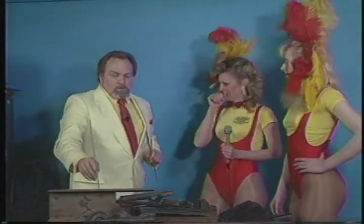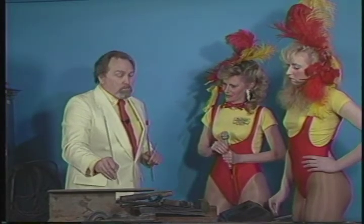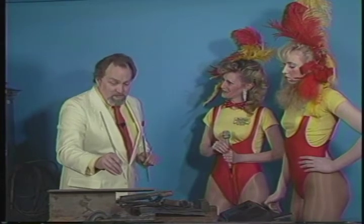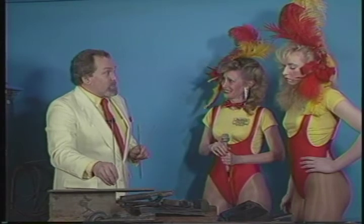And the reason is, in order to properly establish the arc, you scratch it. And part of that scratching motion has to be that you pull away from it. Don't just establish an electrical... Like striking a match. Don't just establish an electrical connection and stay there. You've got to do like that and bring it up.